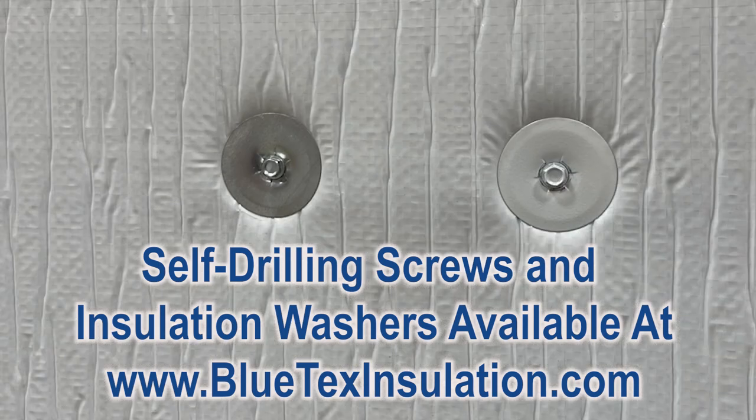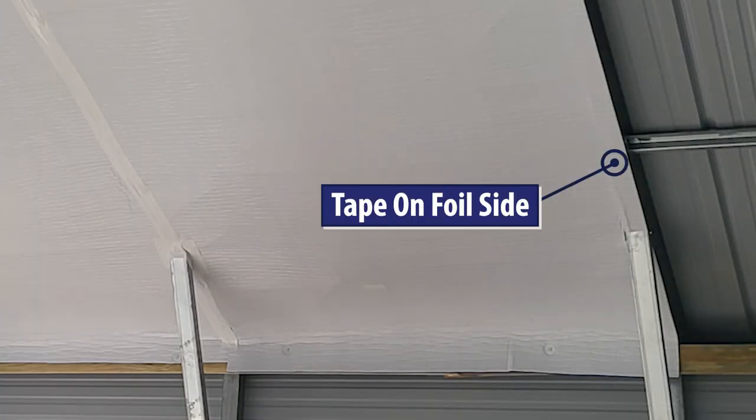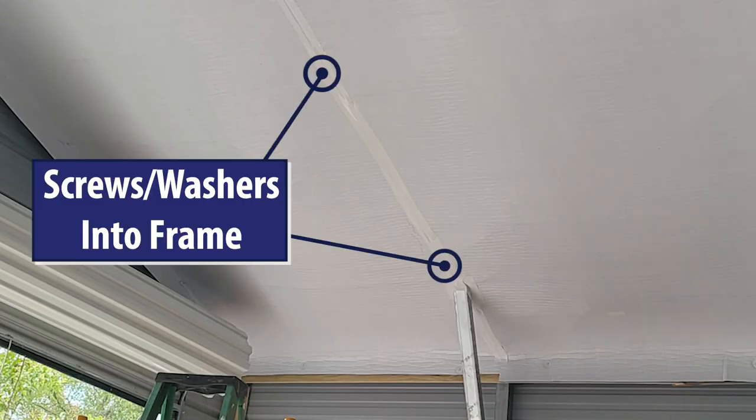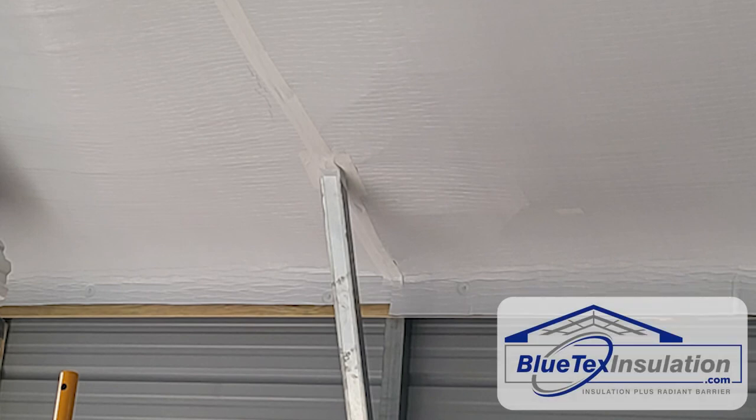Run it up, over, and down, then terminate on the wood 1x4 header on the other side. Then go to your next piece on the roof and do exactly the same thing — tape it on one side, pull it across. Now when you get to that seam, you're going to have two layers of Blutex. At this point, come through with the screws and washers and every few feet, put the screw and washer through both layers of the Blutex into the metal frame. To eliminate any waste, you can actually use the full roll, and when you bring it down to that 1x4 header, use that piece of wood as a cutting board — cut down the middle or use the bottom as a straight edge and cut it off to keep it clean.